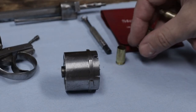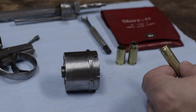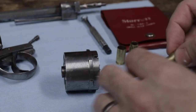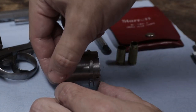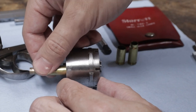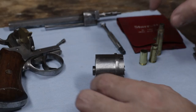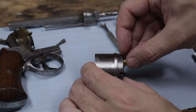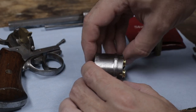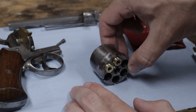The cases will be made from standard brass cases. I can measure their diameter, or fit them in the cylinder as a test. A .223 case fits in loosely, sliding almost all the way through but stopping close to the front, which demonstrates the taper within the chamber. These two cases are a perfect fit — just the right size to slide in easily, and once fully seated, they're a snug fit. It makes sense that they fit the same, since they're both based on the same parent cartridge.